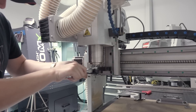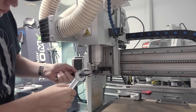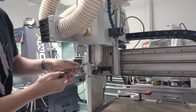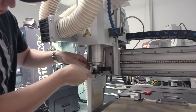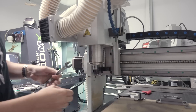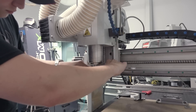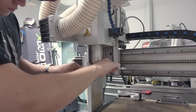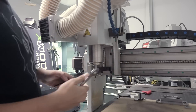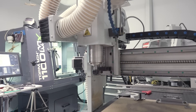So let's get into what we don't love about the 24R. First and foremost, optioning this machine without an ATC is the largest handicap you'll run into — I find myself bashing my knuckles off of the linear rails every tool change. I was really excited to hear that Tormach had just finished developing an ATC for the 24R and those should be available soon. Adding an ATC would be my number one upgrade for this machine and I'd highly recommend it to anyone who has it in their budget. The addition of an ATC and ETS is a great combination sure to reduce cycle time and make the 24R much easier to run.